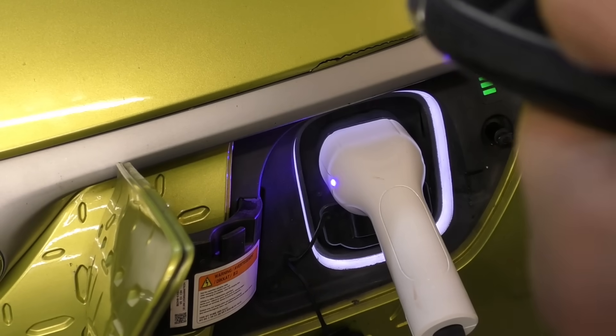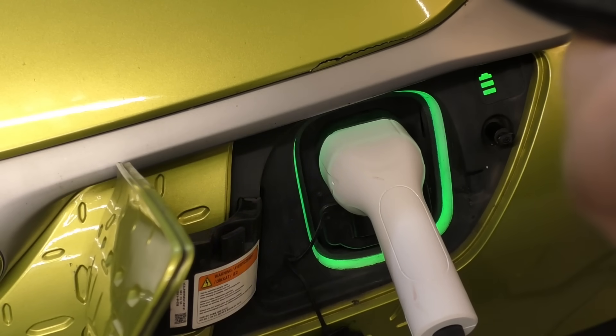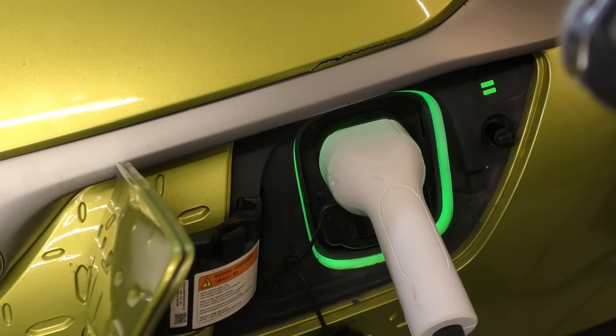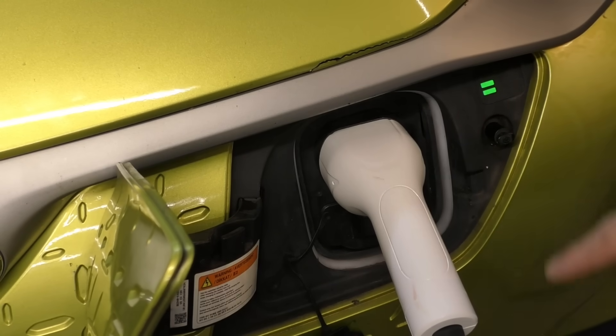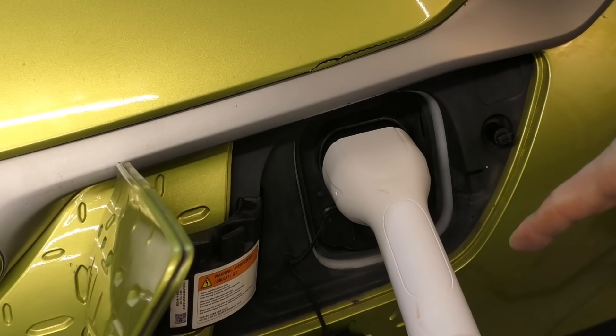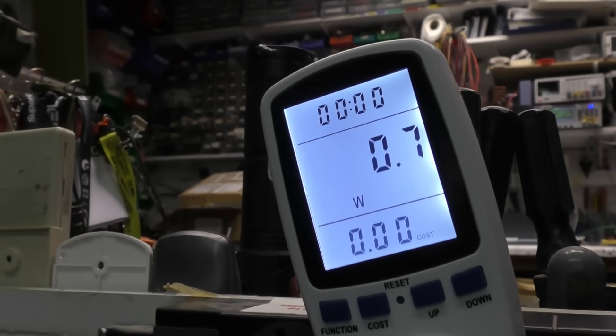The reason for that is that if you're charging at a public charger, you might just want to unlock the car to get in without stopping the charge session. So it behaves fairly sensibly — it reduces the charge current low enough to be safe to unplug without causing any arcing, whilst maintaining the charge session. I wanted to check what happens if we actually disconnect the source of the supply. I've just disconnected it at source and yes, the car has unlocked. Obviously that wouldn't be a good way of doing it because you're disconnecting 32 amps — the switch or breaker you're using will suffer wear and tear if you do that regularly.